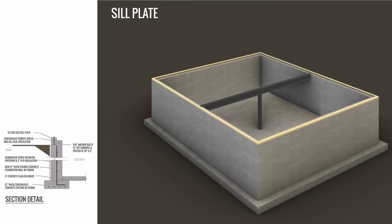After the steel is in, something called the sill plate is fastened to the wall, connected to the concrete wall by anchor bolts — you can actually see it in the section. The sill plate is usually two 2x6s stacked on top of each other and is made out of water-resistant wood, which keeps it from rotting since it's closest to the ground. The sill plate sits on top of the termite shield, which keeps termites out of the wood structure. The termite shield is usually a thin piece of galvanized steel or copper, and it's all sealed together with the sill sealer.